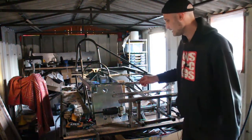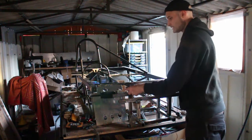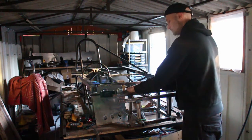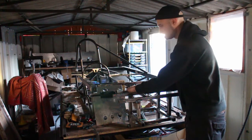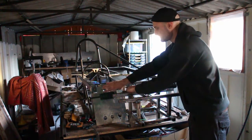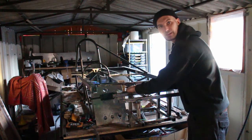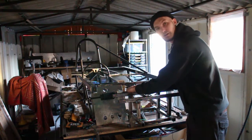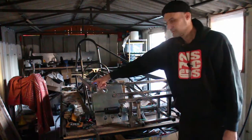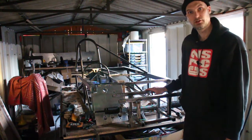If I hold up the steering rack, which needs to be 65mm back from here, it's roughly going to be somewhere around here. You can start to see that this front end is really coming together. I'll probably have to blank off the hole where the steering was going originally and move it across the other side — that's actually a good thing because it means it's going to clear my accelerator and brake pedal nicely. So just the support structure in here to hold it on, and then we're done, more or less.